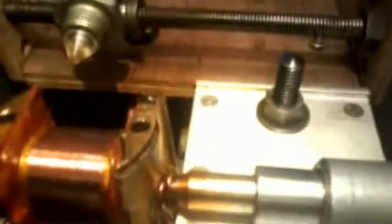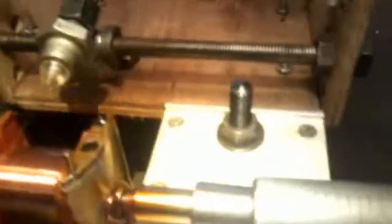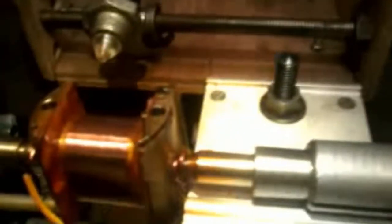Now, some people might think I'm a bit of a philistine — I'm spraying onto my lathe bed here — but it's only varnish, and with oil on my lathe bed it's not sticking, so it'll wipe off. I've just sprayed that on there. Now what I shall do is cut a piece of tape to suit the circumference and to suit the width, put the tape on. The Elmo Firm insulation spray dries — it takes a few seconds to dry — then I'll put my Kapton Tape on and I'm back over for my next run. Thanks.